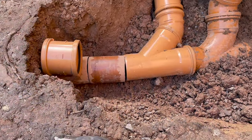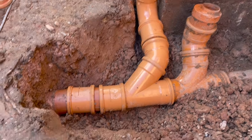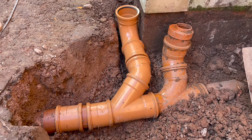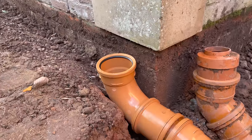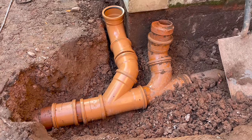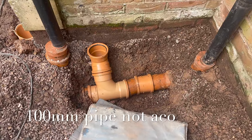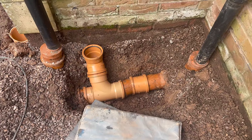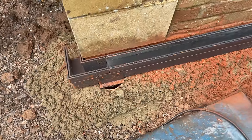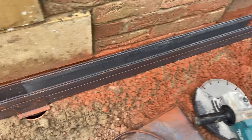I must admit, that was a right pain in the ass — I didn't excavate enough, that was a struggle. But I got it in, so happy days, and this end piece now is actually a lot flatter than what it was earlier. Good stuff — let's backfill it with chippings. I got the last little bit of drainage threshold in there, that's for the small corner. I'll backfill that with chippings and we can crack on. It's time to fit the nice threshold drain on here — so glad we're using this nice stuff.